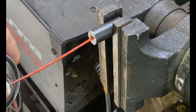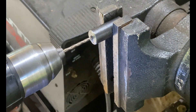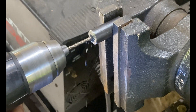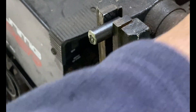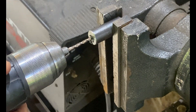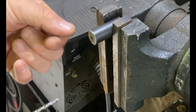You want to get your drill bit in 20 millimeters. We need that depth because our tap needs enough space to put a thread in without bottoming out. Our M4 bolts are cut at 30 millimeters in length, allowing 15 millimeters inside the shaft and 15 millimeters of sleeve.